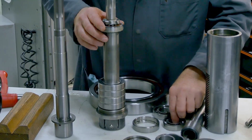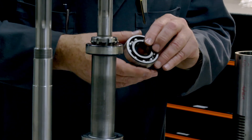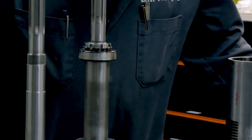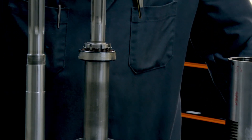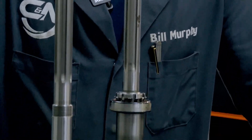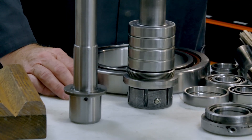This one has a shielded rear bearing with rubber seals — RS. This one was open. The open ones are still great and you're going to get a lot of oil in them. That little cup on the side of your Bridgeport where you oil every day — nobody does. That oil fills up on the top, and when your quill is clear down, that oil runs over the top, through the bearings, and washes the grease out. So don't overdo that one. You can get just as much lubrication on your quill housing by running it down, putting some oil on it, and running it back up — that's going to be plenty.